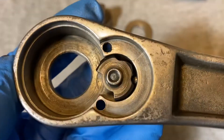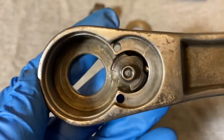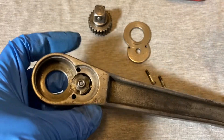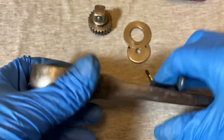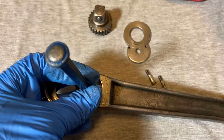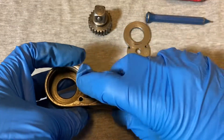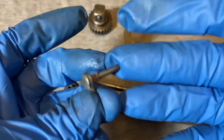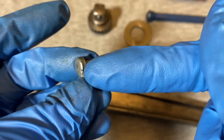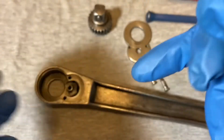Here's a look inside the head — the mechanism housing. To get the switch out, just take a little punch and a small hammer. It doesn't take much and the switch comes right out. This is what the switch looks like — there's like a box towards the switch handle, and that box fits into the pawl.